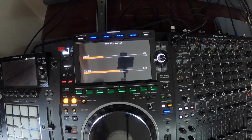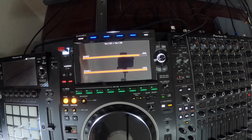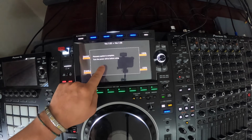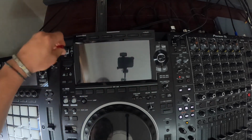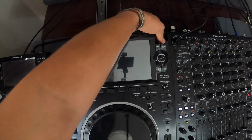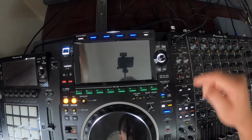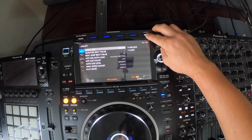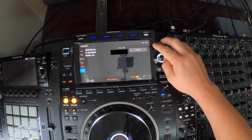and now it's busy updating the version. So we're going from version 1.03 to version 1.06. Firmware update is complete. Turn the power off and on before using. So we're going to switch the unit off. I'll just take out the thumb drive for safety, and then I'll switch the unit on itself. And once it powers up, we will have the latest firmware update on the actual unit. So as you can see, once the device is on, press and hold the menu button, or go through to info, version 1.06.